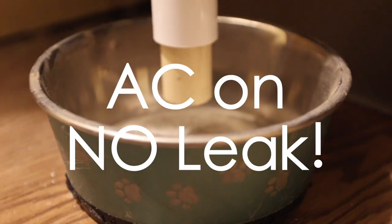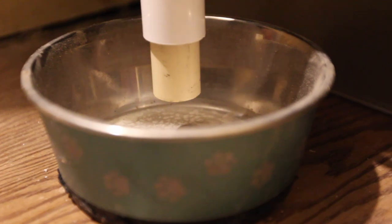So I'm sweating. Let's turn this on and see if it fixed our problem. So when we started the project, we thought that the piping was clogged. It was actually that our P-trap was not even a P-trap at all. It was more like a U-trap. They were totally even. We fixed all that, vented it correctly, and we're in business. No more leaks.